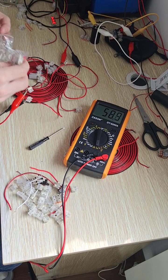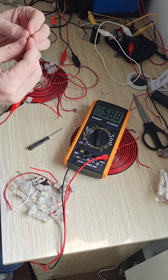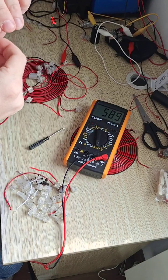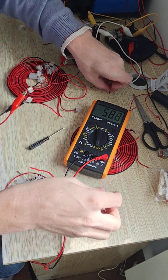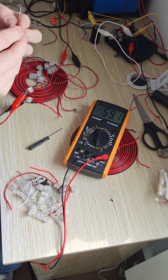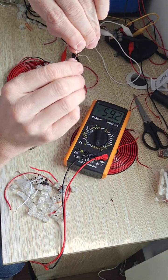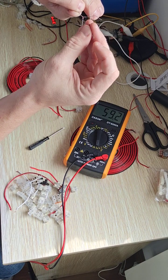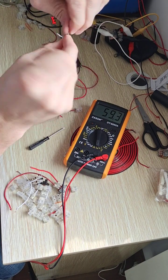So if you haven't seen this done before, you take your four diodes, you get them pointing the same direction and you twist it off. That's your positive out. Same direction, twist it, positive out. And I suppose you could do the same the other way. You put your negative out, so here you're going to twist your negatives together on this side. So again, in this one you've got the black lines pointing out, and then you just join them together, and that gives you your AC legs from where to attach what you want to attach.